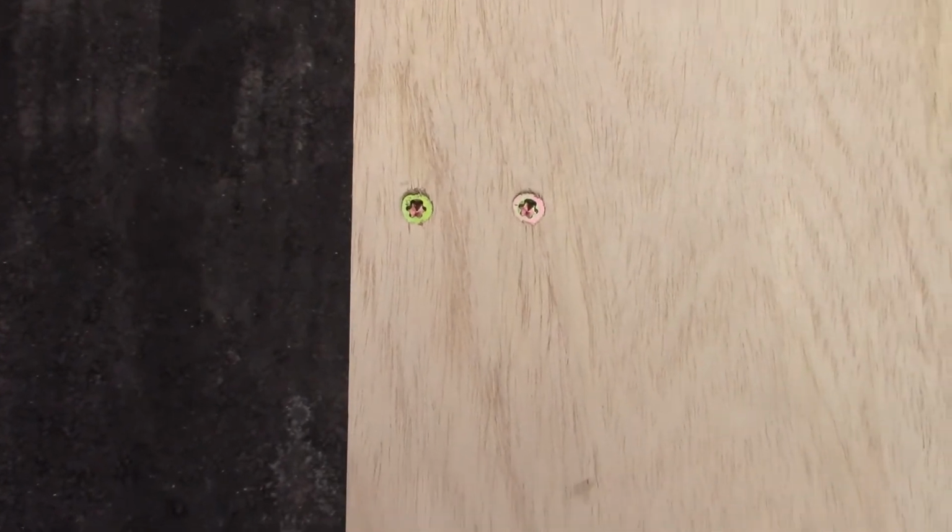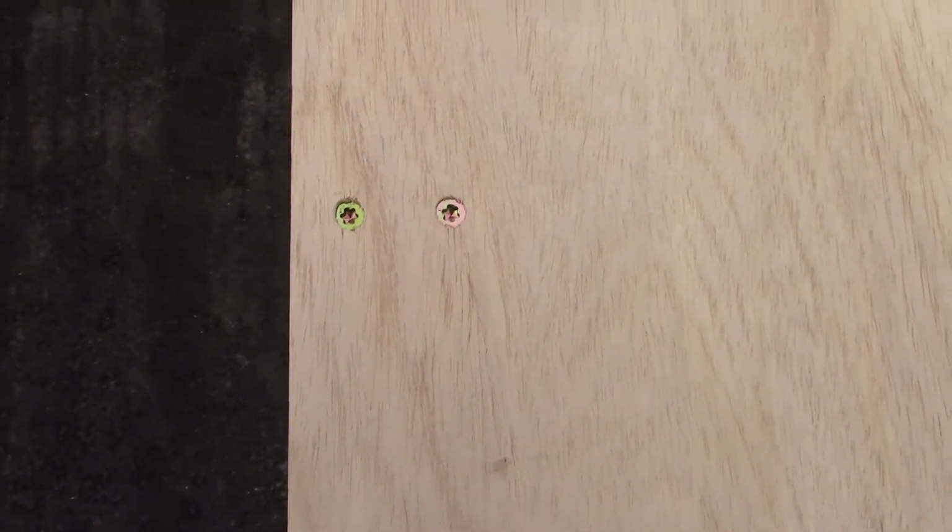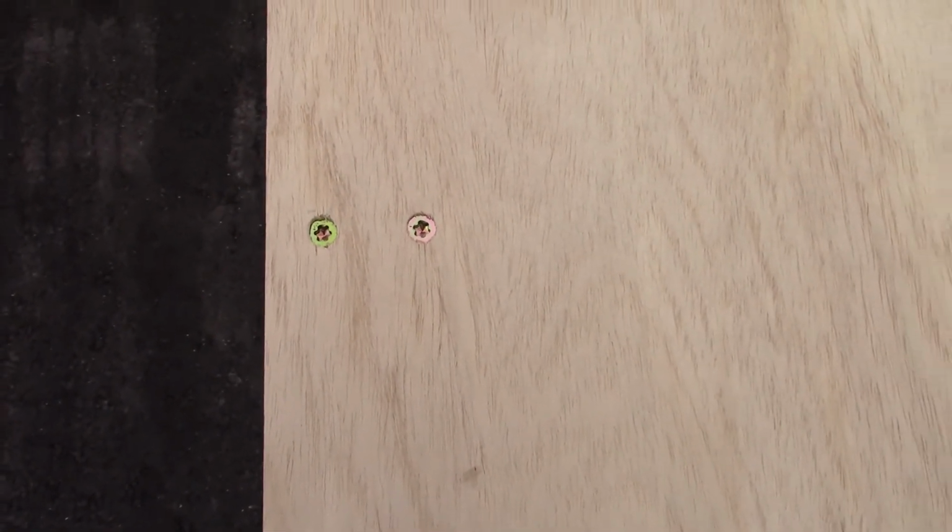But what I did was I screwed down through the top into the 2x4 legs that I had cut. I think these screws are probably 1.5 or 2 inches. Get the longest ones that you think you can drive straight. The more support, the better. Yeah, you can see I went right down through the top of the bed into the legs underneath with this.